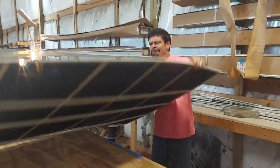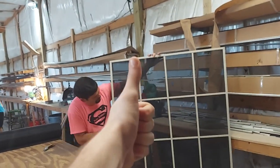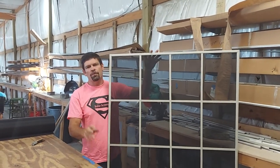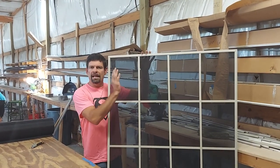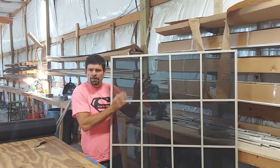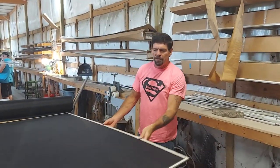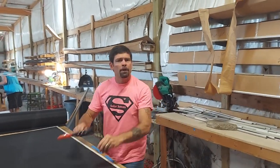Let's sneak a peek at it. Looking good — you can see every bar is straight. By putting your bars in the center, when you get out to your window, if it moves a little bit, that gives you about an eighth of an inch up as well as down because of the way that pin was designed, to allow you to scoot it up or down just in case something sat in there differently or maybe your window's a little crooked. Now I'm going to throw this back down and rivet it.